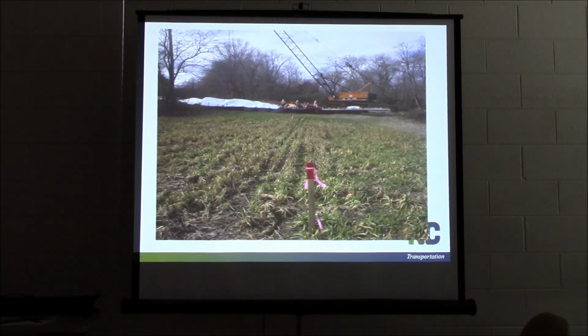It's on the other side of that silt fence. I should have taken a picture of it. I saw it laying there, but that's why it's critical to put these extra reference points in. Keep your line, got extra reference points for the surveyor. Because if they just come in and put the 1 point in, and they got nothing to reference when they come back out in that vicinity.